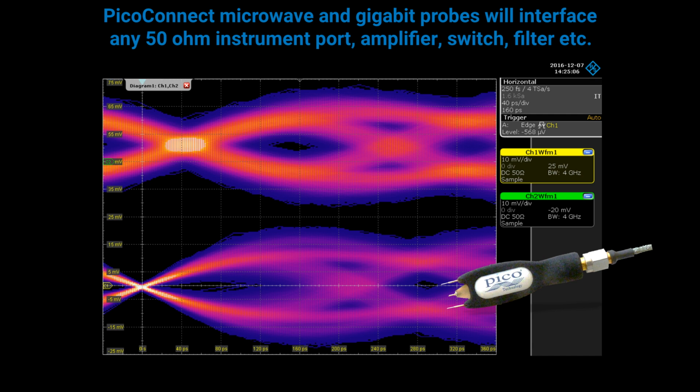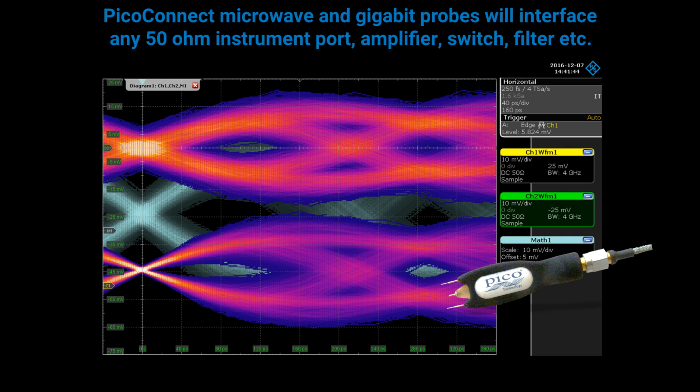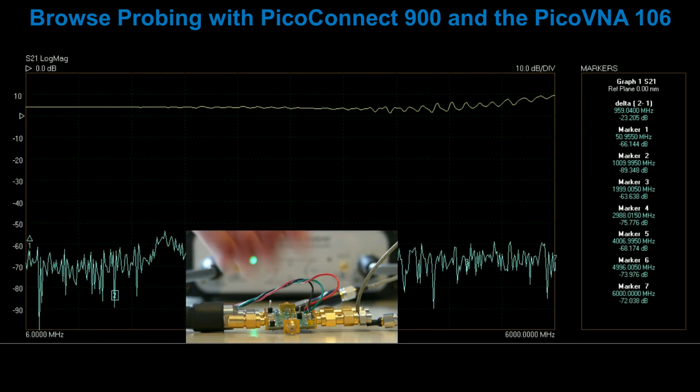This 4 GHz Rohde & Schwarz oscilloscope is somewhat short of bandwidth for a 5 gigabit per second USB 3 data stream. Nonetheless, we can see data flow and timing skew, not to mention high differential jitter and bit interval jitter. Here, divide by 5 probes keep us clear of oscilloscope noise floor. Single-ended probes permit deskew at the oscilloscope, and again an AC coupled probe prevents bias bleed.